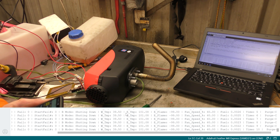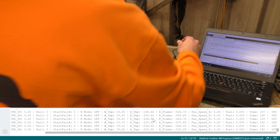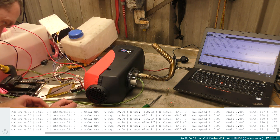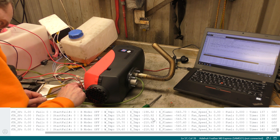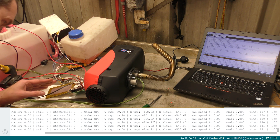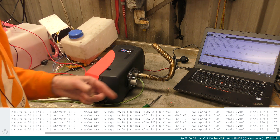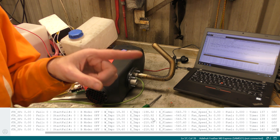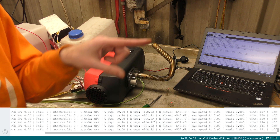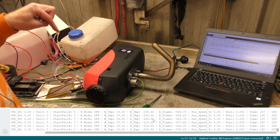Let's shut it down again. I've done it again - I think I've melted the fan MOSFET this time, as it's rather hot. Glow plug survived, fuel pump survived, but I think the fan MOSFET is now gone. I think I might have to upgrade my MOSFETs for this board - they're not quite up to the task. A kind person did leave in the comments probably the best MOSFETs that should be getting used, so I'm going to go back, read those comments, order those MOSFETs, unsolder the ones on another board and solder those MOSFETs in, and maybe get some more heatsinks.